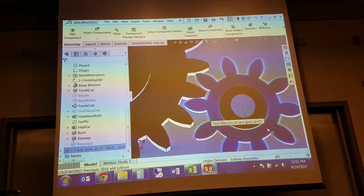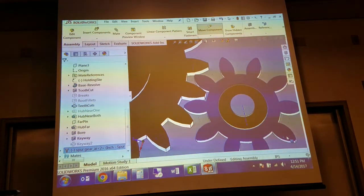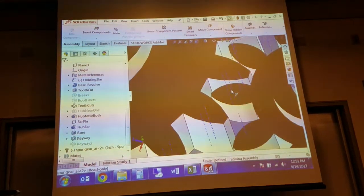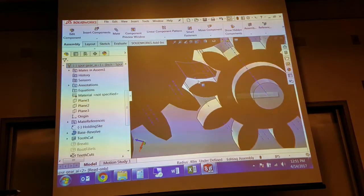To line up the gears, previously we aligned axes. With these spur gear teeth you can see there's no that curvature in there with the corresponding axis, and you don't get full engagement — this is a more realistic tooth structure than the ones in last week's assignment. To line these up, what works best is to put in a tangent mate between those surfaces. That shows you what the contact would look like when they're properly meshed.